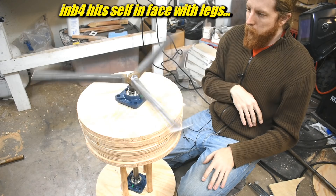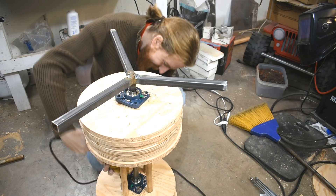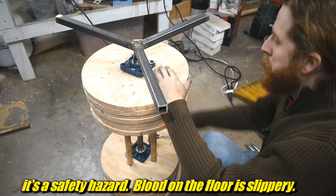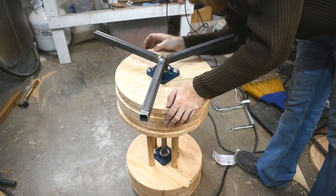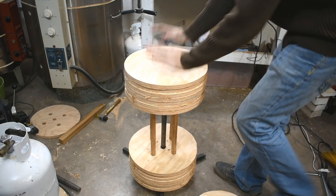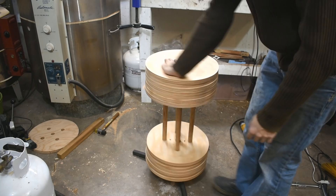Actually, not so simple, because this isn't sitting straight — I don't have these panels on quite square. Probably just gonna ignore that and keep going. And if anyone has a plan for how to cover up these spikes of death, please let me know, because that's gonna become a problem at some point. I only put in two bolts top and bottom — those things go in hard and my air compressor's not plugged in. I also tightened the set screws on these collars top and bottom. And now we're gonna see how it works. Oh, this thing is heavy. Moment of truth. It works! It's a little wibbly wobbly right there — but does it work with a kick? Yes. Functional parts done.